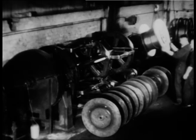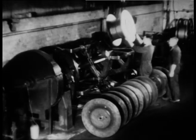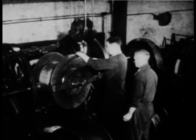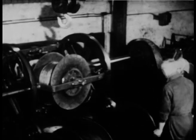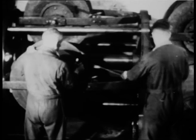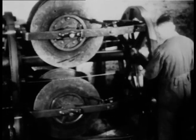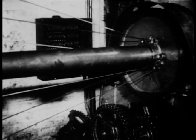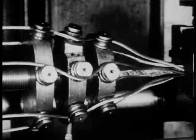Big closing machine. 6 bobbins of strand are loaded in, each of them consisting of 19 wires. The closing machine also is of the sun and planet type. Strands, similarly, are led down. The gear wheels are adjusted while the loading proceeds. The strands have been formed to a predetermined twist and direction. Here, the strands are preformed into the helix they will occupy when finally closed. The machine starts up feeding the strands into the compression lines.